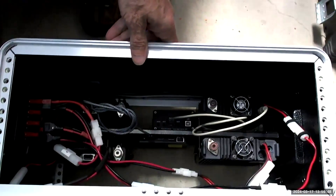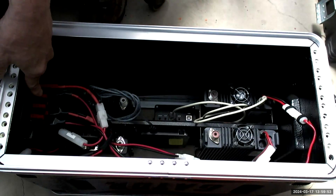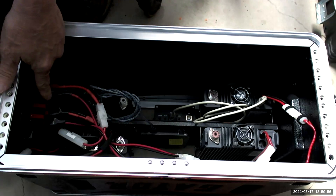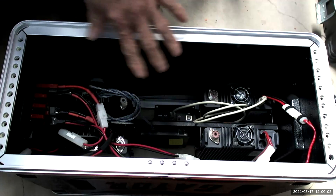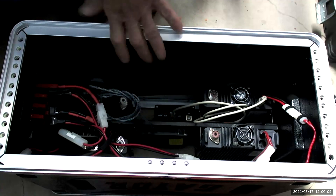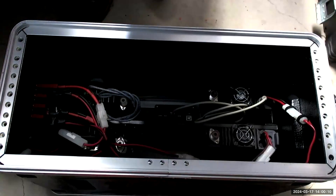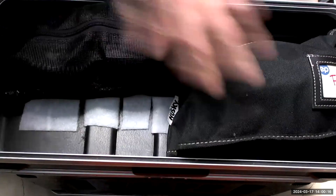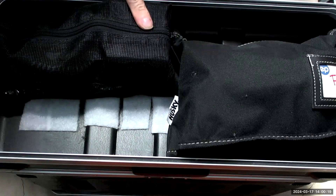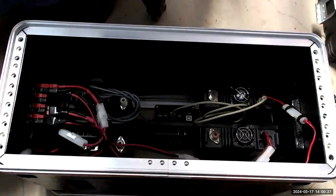Everything's mounted up in there and pretty much ready to go. We've got the PowerPoles ready to plug into my power source, and I can separate them off depending on what I want to support. You connect up your antennas, and there's a USB connector for the SignalLink that I can pull out to the front and connect to a laptop — then I'm ready to go. I also mount these little mesh bags with Velcro to the cover, and inside I keep microphones and all the accessories needed to connect these radios, so they're always with the box.